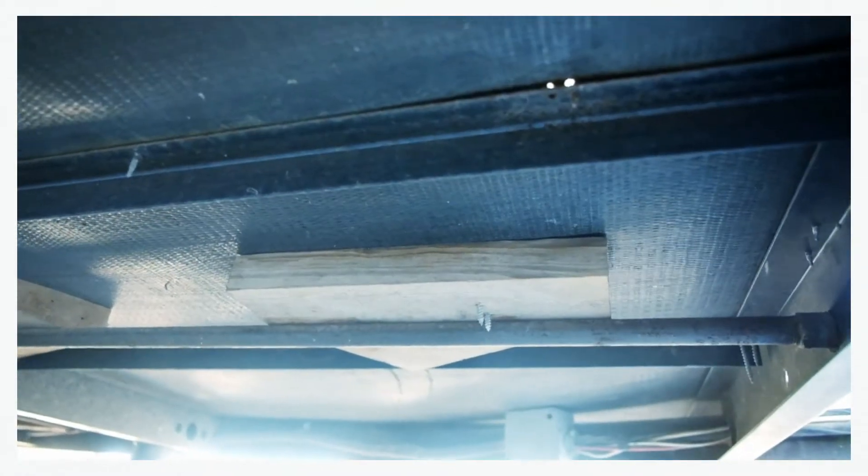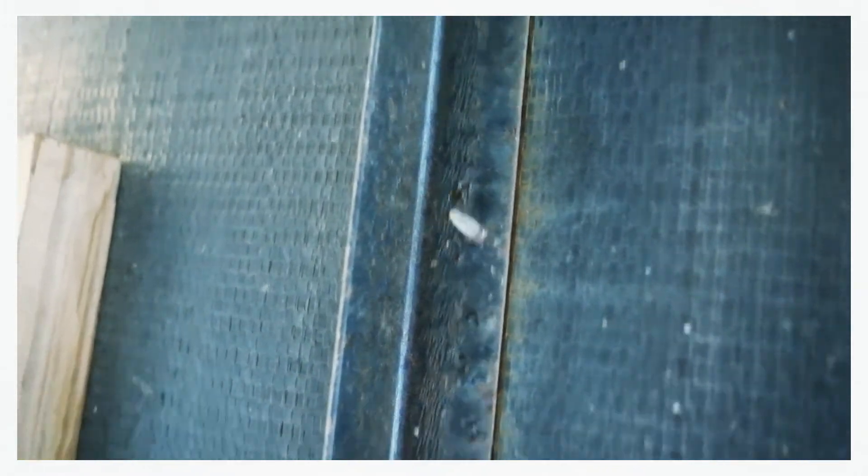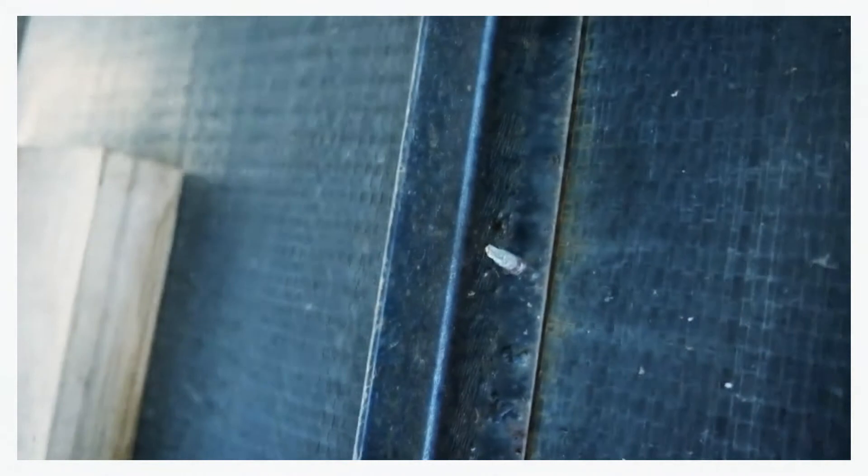As you can see, this is a good sign of some really professional handiwork — someone put some boards under here and put it on top of the gas line, so when you step down on it you're putting all your weight on that little pole. Also as you can see, someone took the time and drilled right into the frame. They didn't use the original bolts. Right down there in the corner are the actual bolts they used to bolt down the subfloor — it's pretty rusty.